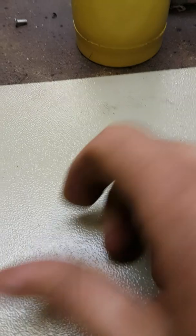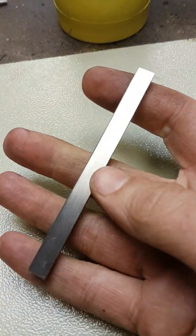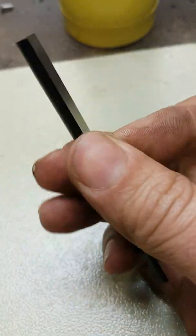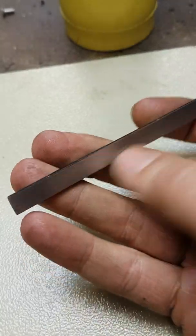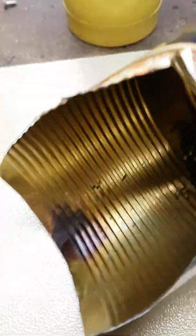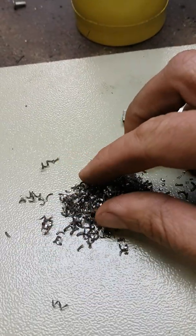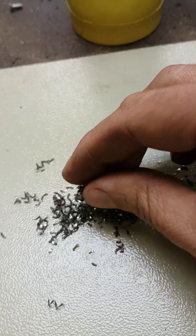So here's our rod. Good finish as I say. It's machined a lot like cast iron which I guess... I don't know, there's no other additives other than the cerium so maybe it's similar. The chips - let's have a look at these - are incredibly brittle. You've only just got to touch these and they just crumble away to powder. There's nothing of them.